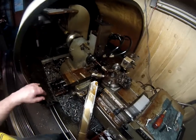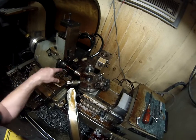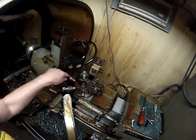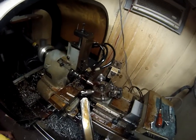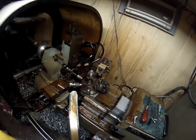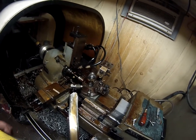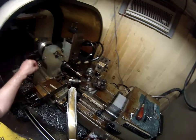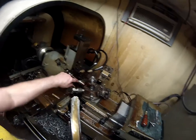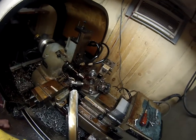There's the rough, and now you can see both cross slides — front and rear — are engaging into the part, and the turret. So it's got one, two, three, four form tools engaging the workpiece now — forming the back end of the part and forming the contour of the bolt head. It's like a carriage bolt head, and putting the 60-degree joint there that will be brazed with rod after.